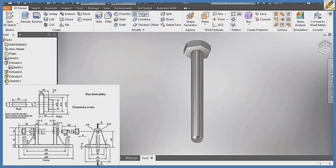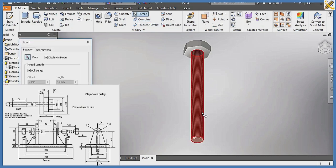Okay, all right then it is a threaded part, but the thread, we don't need to do the thread to the extreme bottom. So I'm going to thread it to a length of, let's see, since this is 150, 140, let's assume 78 plus 20, that's 98, let's say 100. So 100 minus 140 is 40. So let me do the thread to the length of 40. So making it a thread length of 40.